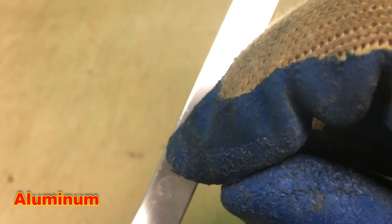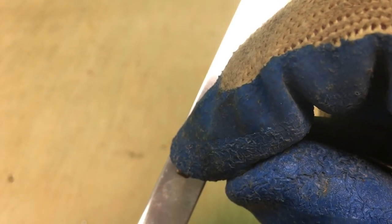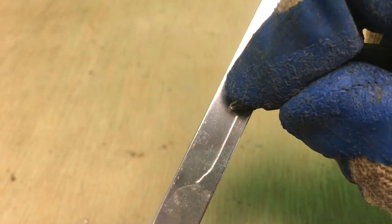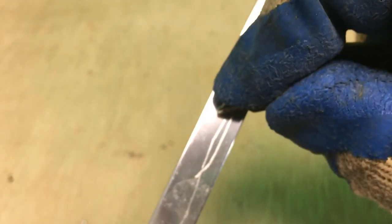Right here I have a piece of anodized 6063 aluminum. Whenever I scratch into it with a key, it actually takes a lot to get it to scratch, and that's probably because it's anodized. This is why I like the key test because it's fast, but sometimes it's not the best because you might think that took a lot to scratch through — maybe it's stainless. It could confuse you a little bit. But I would just know that this is already 6063 aluminum.